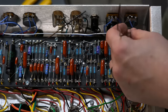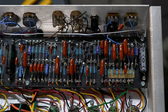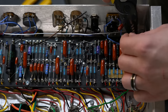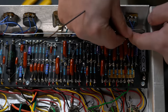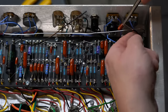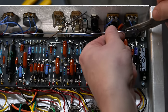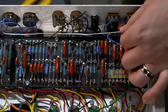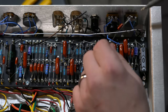For this one I don't need a huge amount of wire. I've heard a lot of different stories about the best approach, but what has worked for me is giving myself a lot of lead and stripping back so I can wrap it around several times. Some people say that's a pain to undo later, but for permanent connections you want them as rock solid as possible — a solid physical connection as well as a soldered connection. The solder is insurance for what should already be a good solid physical connection. So I'll go ahead and solder that so we'll have that ground done.